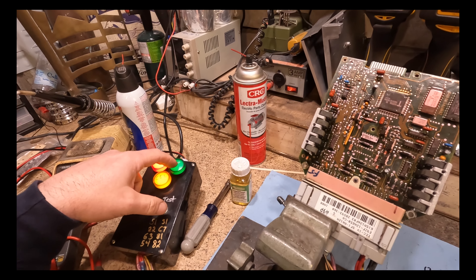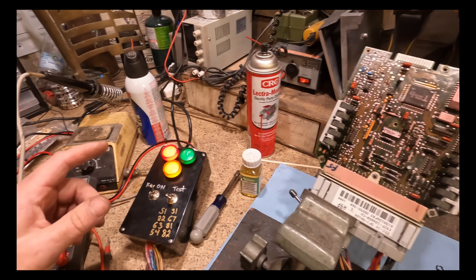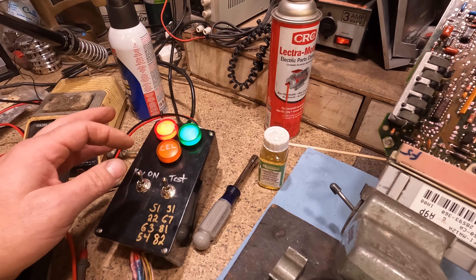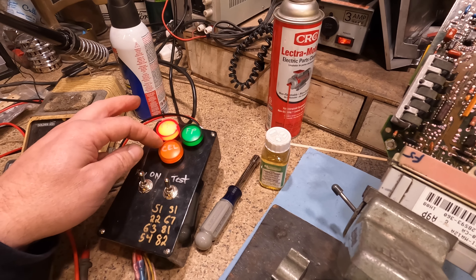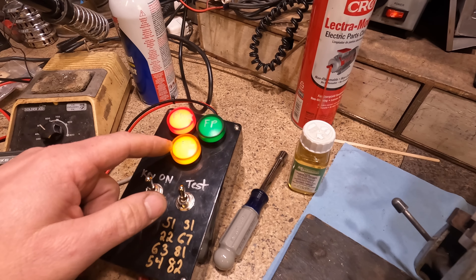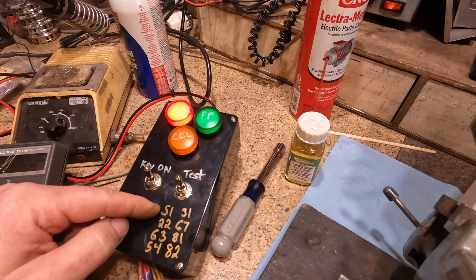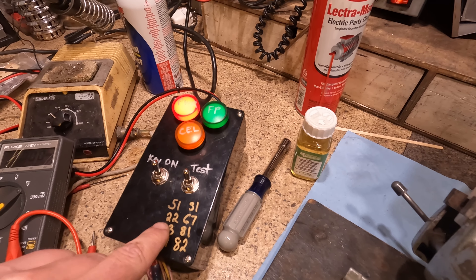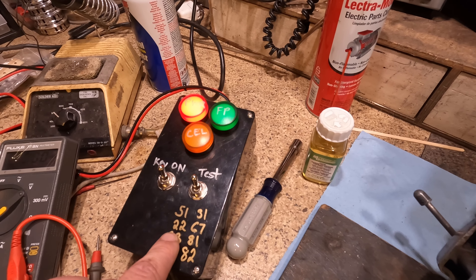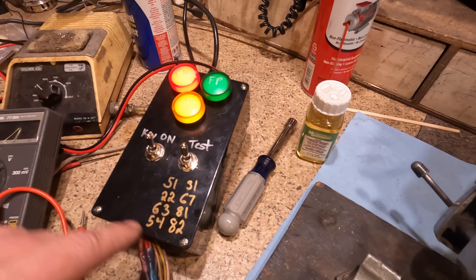Power's on — one second and the fuel pump goes out. Check engine light on your dash comes on and stays on because the engine isn't running. The fuel pump cycles. It starts flickering — the computer is alive and active, starting to give us flash codes. There's one, two, three, four, five — pause — then one. There's our first code. Next one is two, pause, then two. It should go down the whole list. I'm not going to sit there and bore you with that, but yeah, this sucker's working now. Good fix.